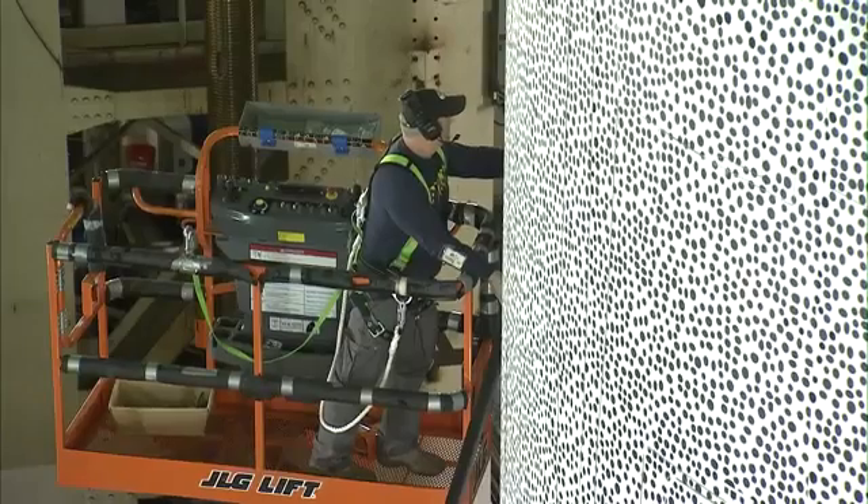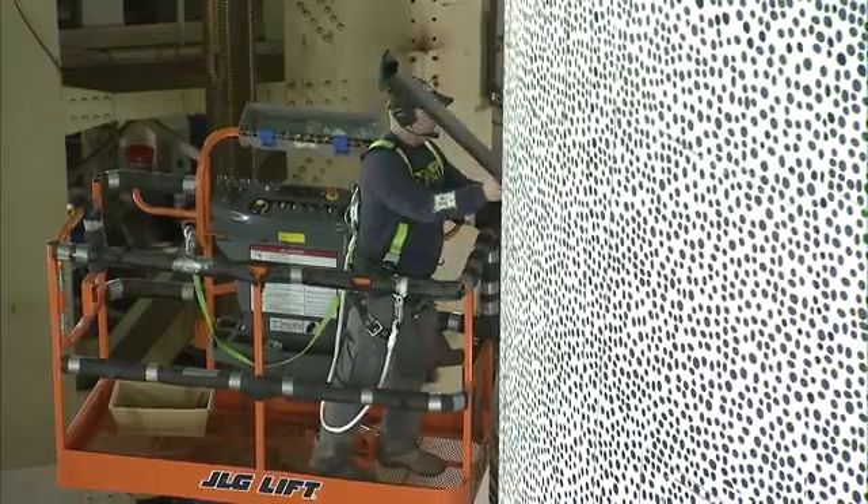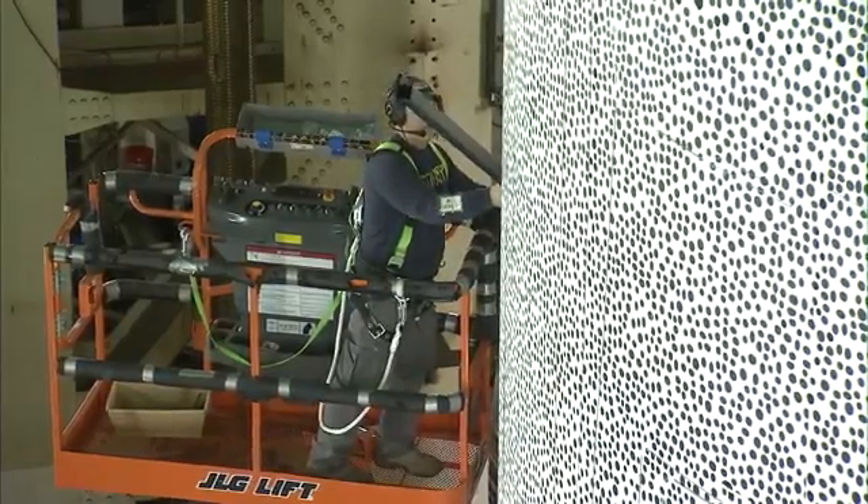In this test, we're going to be trying to simulate a lot of the same types of loads that a launch vehicle would be subjected to during flight. That includes internal pressure associated with the fuel tanks, as well as flight loads — compression-type forces and bending forces — similar to what would happen if you crushed a beverage can under your foot.